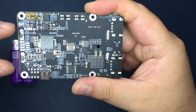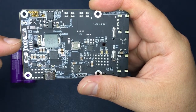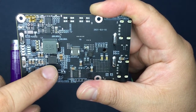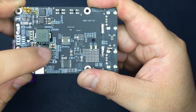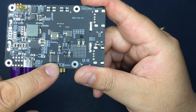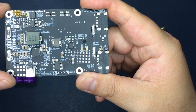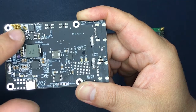These LEDs indicate power-on and power status, and these four LEDs are supported by the PMIC chip called IP5328. This area is the PMIC function area, and here is the main chip — the MCU — which communicates with all of these components and gathers information to communicate with your Raspberry Pi via these two pins.